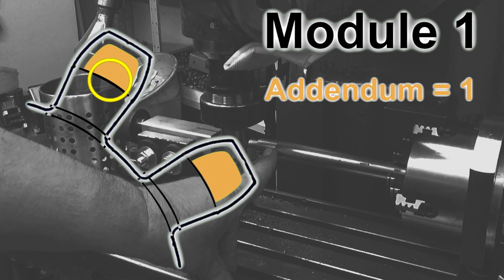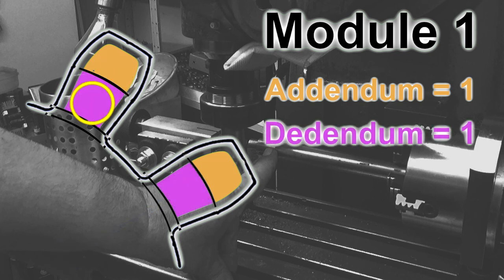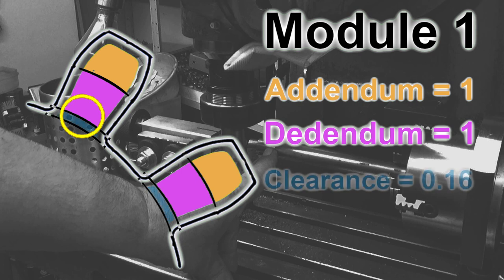Since the height of addendum is 1, the major diameter of a 16 teeth module 1 gear is 16 plus 2, which is 18. The bottom part of the tooth, including the clearance, is called dedendum. Dedendum itself consists of two parts, the lower part of the tooth and the clearance. The height of the dedendum is 1.157 times the module. The 0.157 is the height of the clearance.